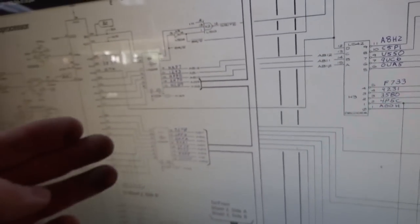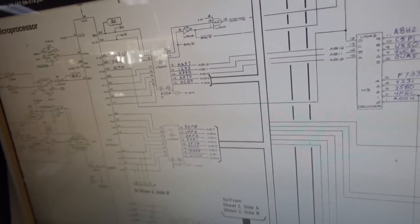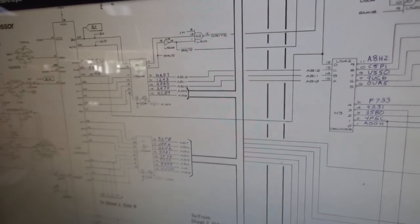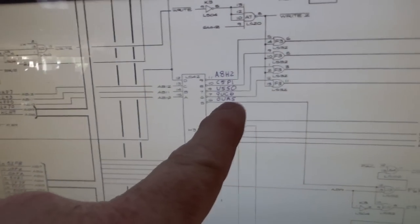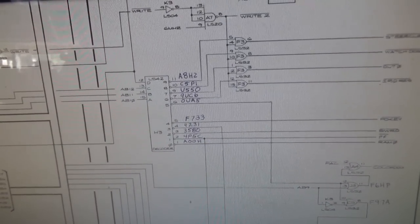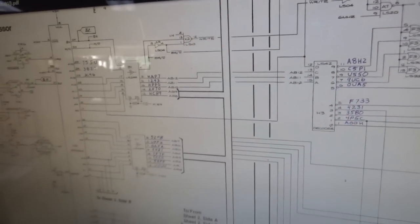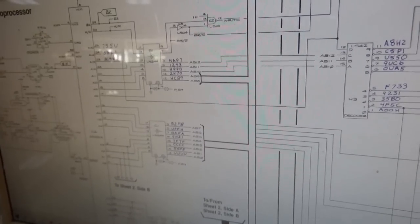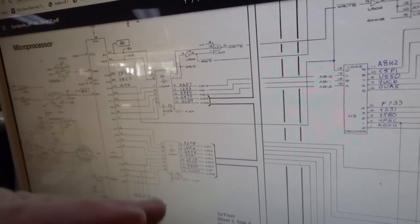Basically the MPU is starting up. It's going low and then high. It's resetting. It's got the clock and everything. And the MPU starts trying to do its thing, which is run Centipede. So it starts trying to talk to the EEPROMs. It's trying to talk to the RAM. It's trying to talk to everything. Talk to this chip and tell it to reset this line so that the watchdog doesn't screw up. Or not reset the line, or however they've got it set up. Control the watchdog. Right? And it's not pulling that off. So since it doesn't do that, the watchdog thing fails and it resets and does it again and again and again.